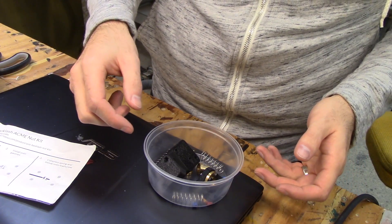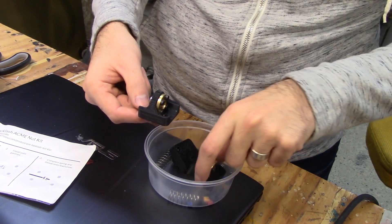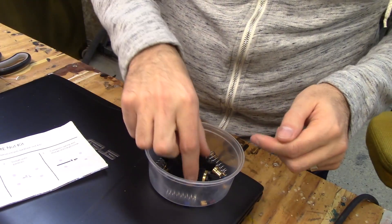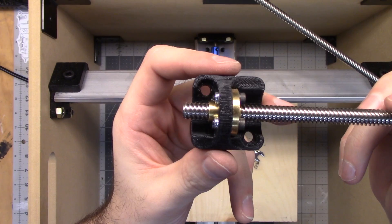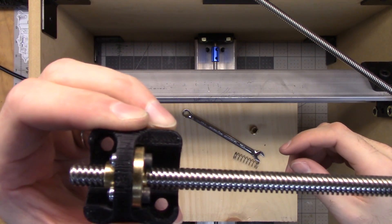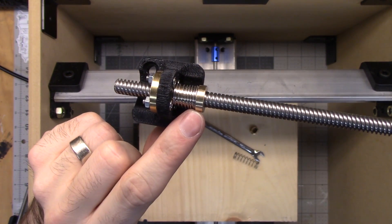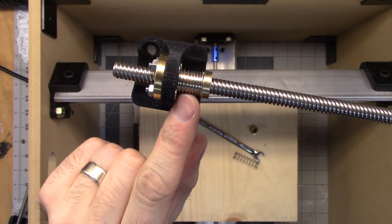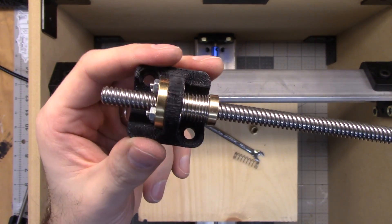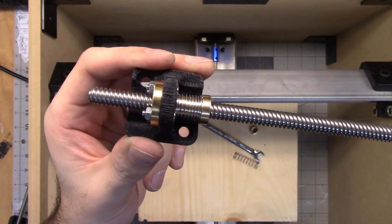In my rush to lay everything out on my worktable, I didn't realize that these parts I thought were spares were actually part of a separate modification that came with my Mill 1 kit — an anti-backlash kit. This is a stock standard nut and lead screw that ships with the Mill 1 — you can hear it vibrating; that's no good. Here's one with the anti-backlash kit installed: there's the normal nut, but then there's a secondary nut. Whenever one nut spins, the other is forced to spin, and a spring between the two pushes them apart. That takes up any slack between the threads on the lead screw and the threads in the nut, and that eliminates the backlash.